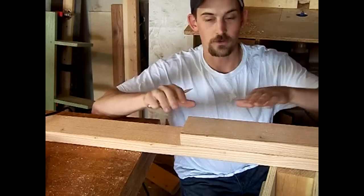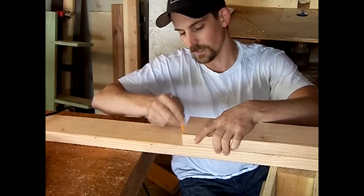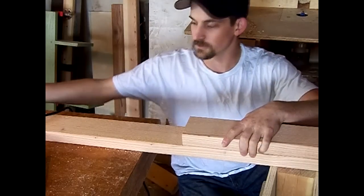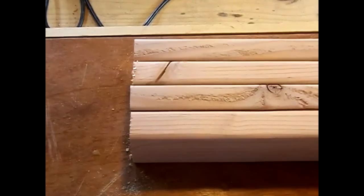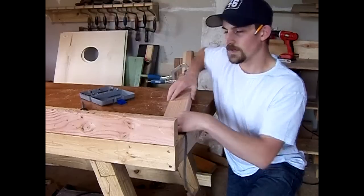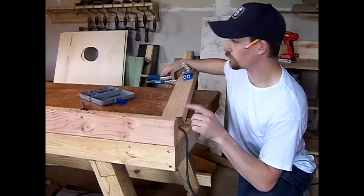After your first cut, make repeated cuts the same length by butting the first piece against the edge and drawing your line. Make sure to always use that original first piece as your reference — otherwise the lengths will gradually get longer. This gives you four identical pieces with no sanding or adjusting needed.